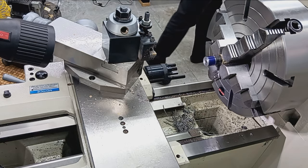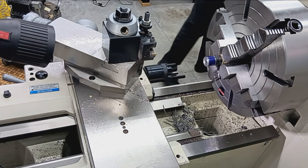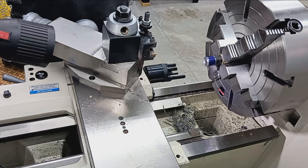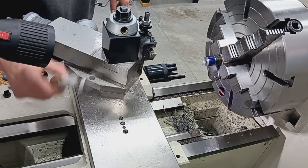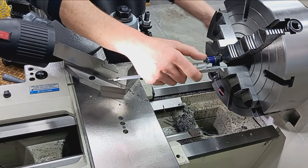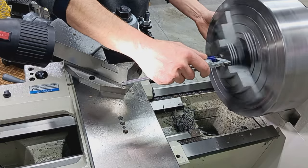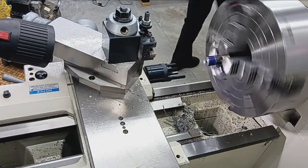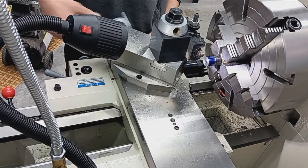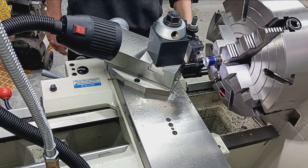So now we're going to go ahead and lay out our length and turn the tenon for a 5/8-24. I always go kind of 600 thousandths and then walk the shoulder back to about 5/8-ish. Just depends on where that break wants to line up. Okay, there's that. Bring the tool in, make sure my cross slide's locked. Yep. So I'm going to take a pass up to that scribe line, set a zero,